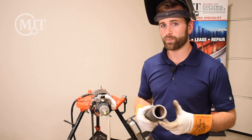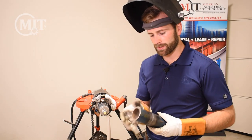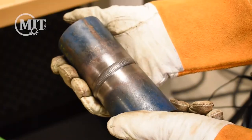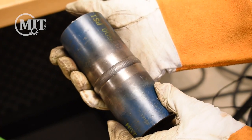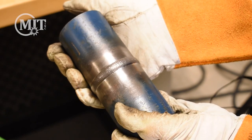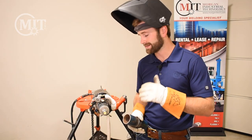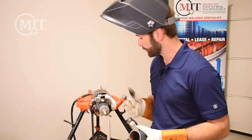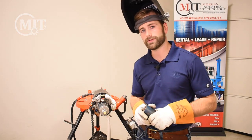That's a quick overview on welding with the Magnatech D-Head. Here we've got a finished weld — typically on schedule 40 carbon steel like this it would be a root pass, fill pass, and then the cap pass. You can see a very consistent weld all the way around, which is what you get with welding automation. The D-Head is a TIG welder, so any TIG-able alloy you can weld with the D-Head — carbon steel, stainless, Inconel, and many others.